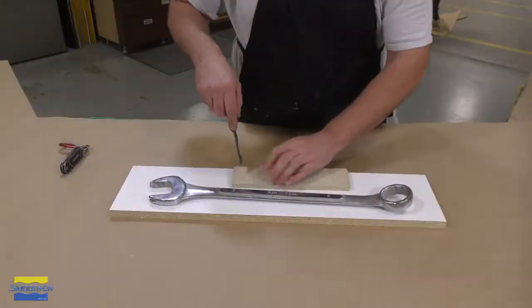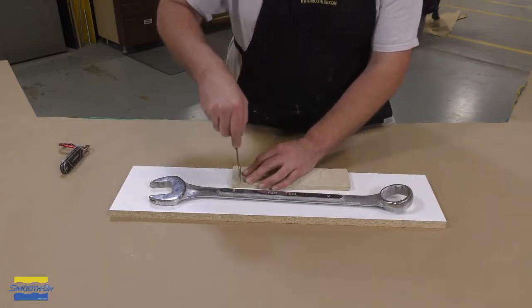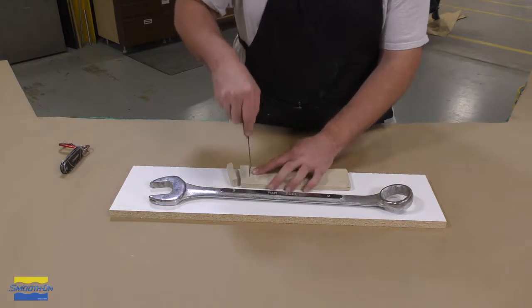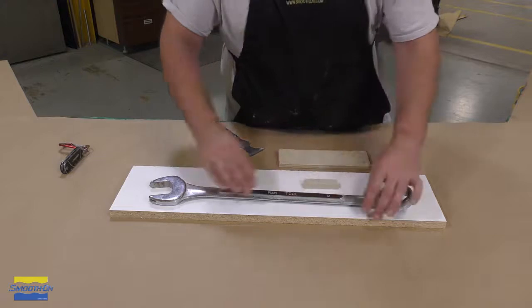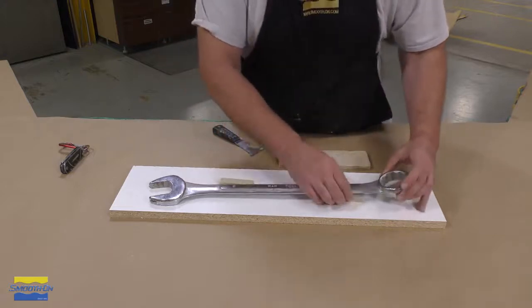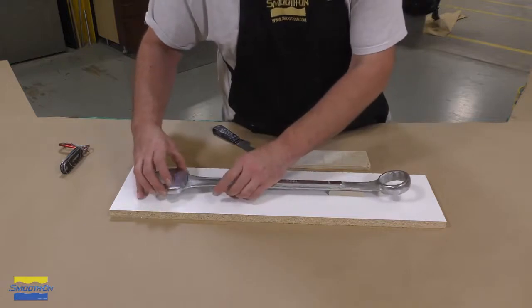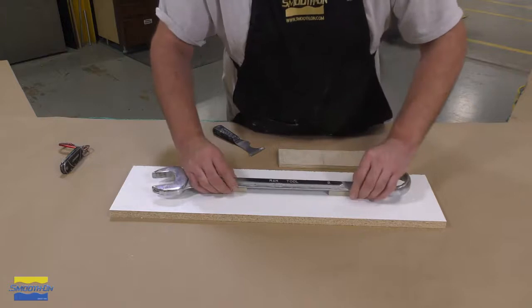To start the project, we first need to set up our model onto a piece of clay. And for that, we're gonna first cut up some of the Sculptex Soft. This is sulfur-free oil-based clay. I usually embed my models in clay to make two-part molds, but in this case we're going to use both clay and alginate to make the first half of our two-part mold.